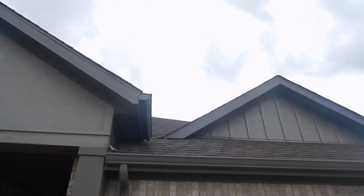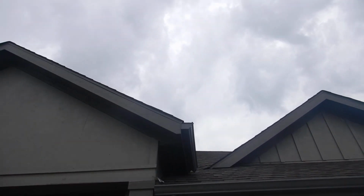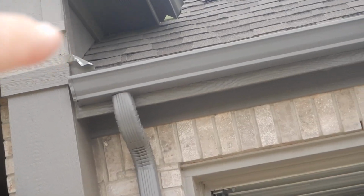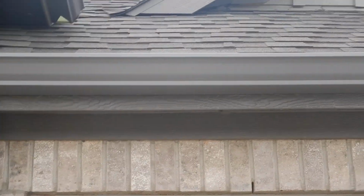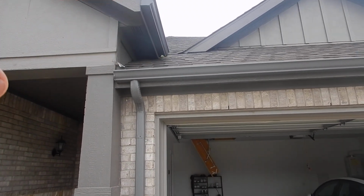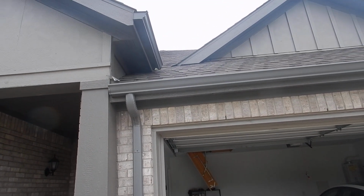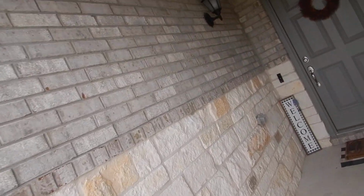Now this is something I've been made aware of, so I carry what I learned forward. And sometimes it's good information. The rain gutter should not discharge directly onto the roof covering. That'll cause the shingles to wear out prematurely. Now, we are in North Texas. These roofs won't last 14 years anyway. So, also, the cure, as you walk up to the house, you'll see the downspout across your rooftop. And sometimes the cure is worse than the ill. But I'm bringing it forward.